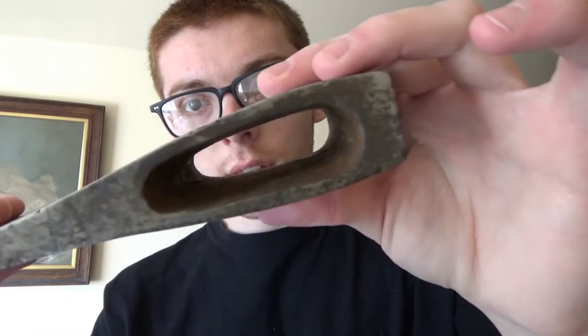I will file the insides to get any stuck epoxy out. It's quite clean as you can see. My main focus is going to be on this bit of the wood - I'm probably going to file it down, and first off I'm going to try and remove all the epoxy, then I'm going to try and make a wedge for it. Either way, I'm going to work on this head bit of the handle and just get it so that it's not all covered in rust or whatever that is. Remove all the epoxy, remove whatever that metal thing is, and then just put it back on the axe head and hammer the wedge into place - or whatever I decide to use as a wedge. It doesn't matter what I use, what matters is it will function as a wedge.